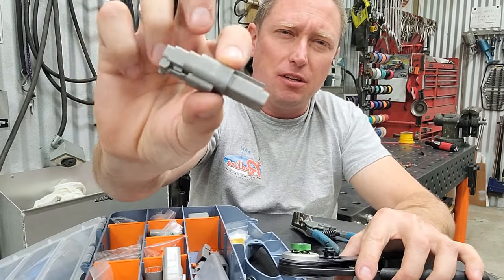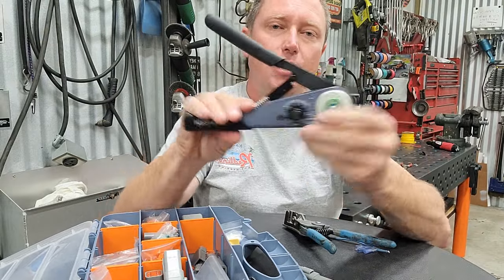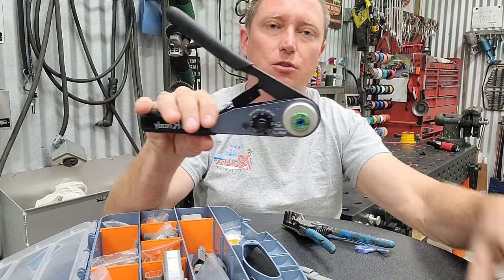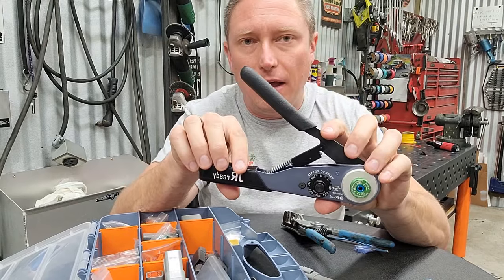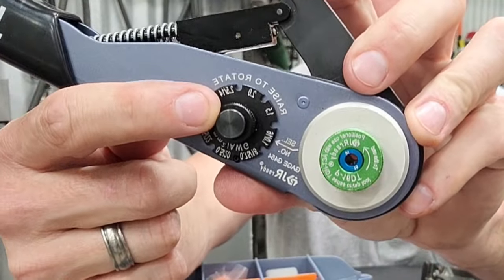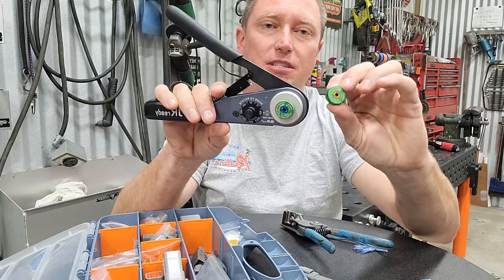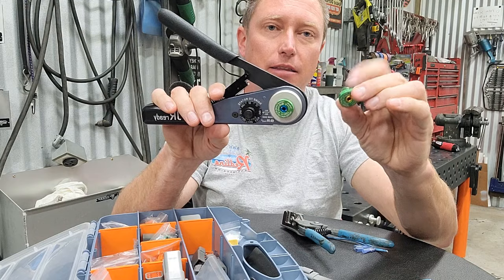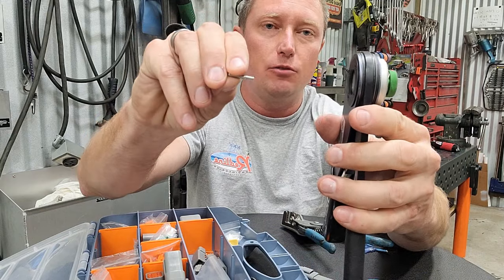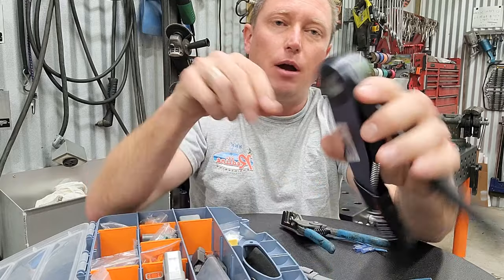So first let's talk about what makes those little connectors so good, and we'll start by talking about the crimpers. This is the crimpers that came with my kit. You notice just an immediate difference between these two. These crimpers will do between 12 and 22 gauge wire — all you do is rotate that little knob right there to set the crimpers up to crimp what you want. You've also got different size little stops that thread into the pliers right here, and they determine how far your little electrical connectors are allowed to slide in and out of your crimpers so that you get it crimped at the proper location.